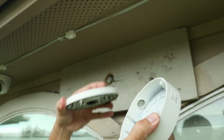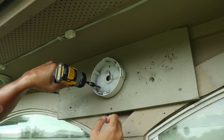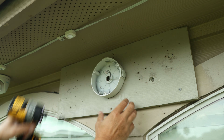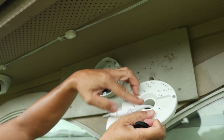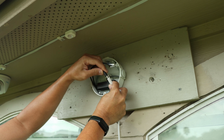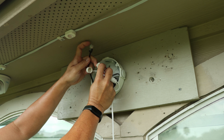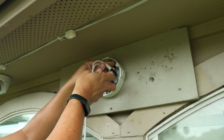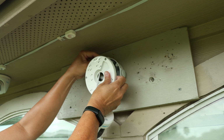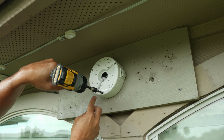And I will link all these items down in the description below if you want to set this up like mine. Let's open up the junction box, feed the Ethernet cable through, and screw this into the wall with the 3 included screws. Plug the cable to the PoE splitter and feed the camera cables through the junction box cover. Plug in the barrel plug from the PoE splitter to the camera and plug in the Ethernet connector to the Ethernet port of the camera. Tuck all the wires in and replace the cover of the junction box. Then screw it in using the included 3 machine screws.